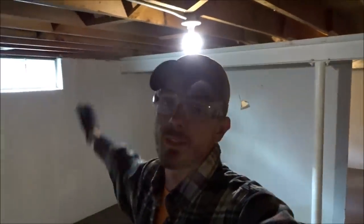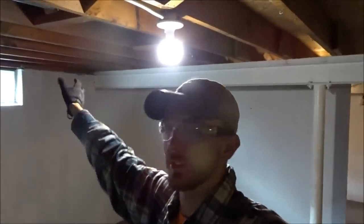But the most important part, which you always want to check with your local building department, most of them are going to require that the window is Energy Star rated, with all the numbers and values, the U factor and everything. They're going to want the sticker. As much as you might think, what a waste, or why do I need this for basement windows, at least the town that I'm working in requires this sticker for these windows, even for a basement, because they just do. So I can't just throw in any old $30 or $40 window in the basement. I have to use these specific windows.